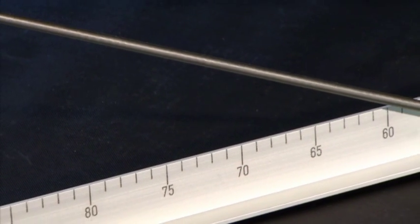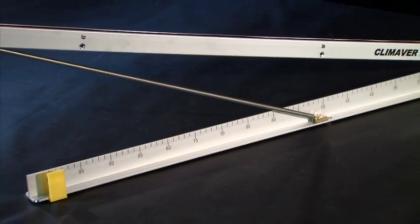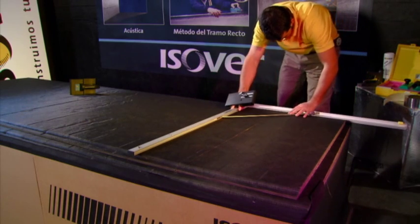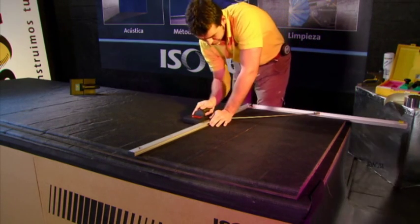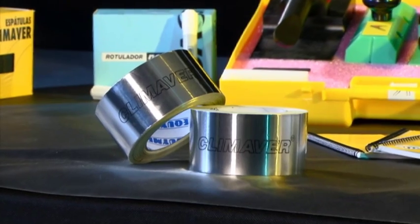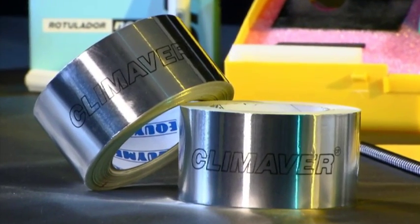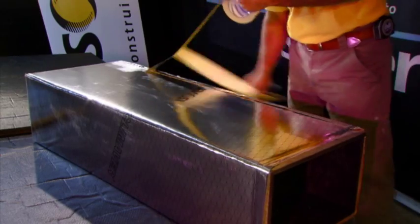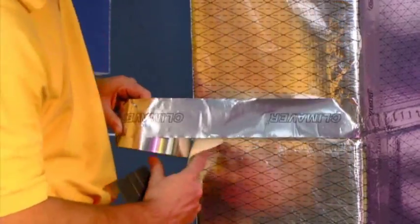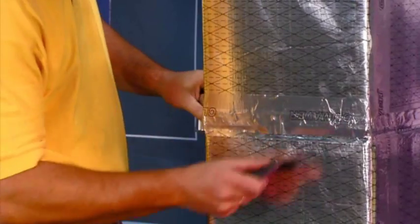The KlimaVair square ruler is made of aluminium and can be set at pre-defined angles: 45 degrees and 90 degrees. It makes the assembly of straight ducts from a flat duct board extremely easy, as it is calibrated to allow the duct's dimensions to be measured along the bottom of the duct board. The KlimaVair tape is a 50 micron thick and 65 millimetres wide aluminium tape. It is used in the longitudinal joints to seal the overlap and obtain straight ducts, and also in the transversal joints between two straight ducts. The word KlimaVair is printed on the tape as a quality reference.